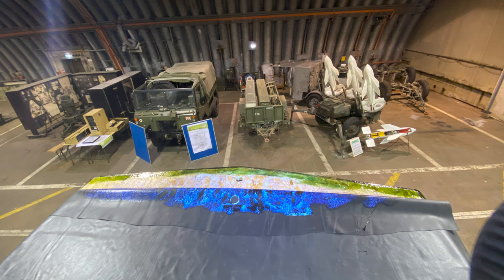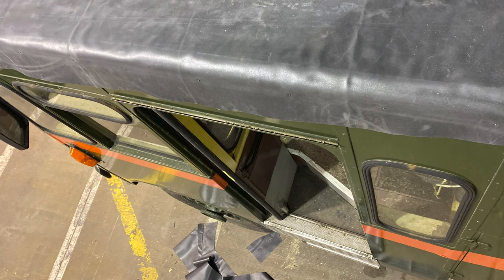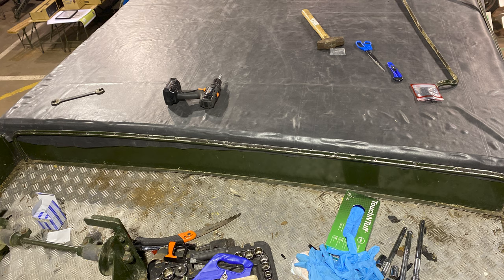This is what it looks like when it's been completely painted on — you can see the clear green outline. Make sure you cover the front of the frame as well, not just the OSB but the frame that's going to wrap around and get nailed into. I've gone around the front, left hand side, and back side with this contact adhesive and pushed it all down and smoothed it out. You can see I've put in some nails as well to hold it in place on the front, left, and right sides. You can see on the floor I've cut off the excess material.